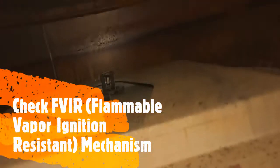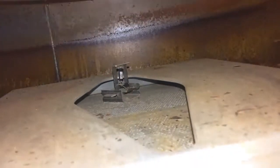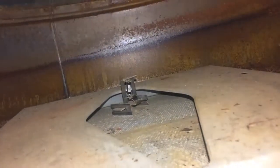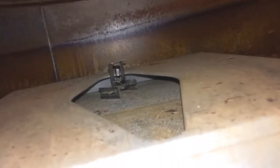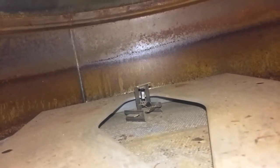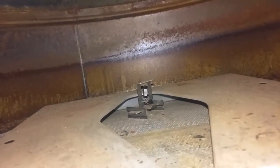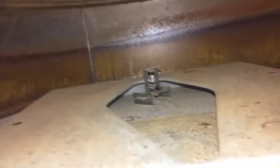The heating chamber, you can see there is a little device in there. That's actually the device to make sure that nothing has gone wrong in there. It's like a safety device, and that looks fine because you see that there is a little capsule or little bulb in there that's still intact. Usually if something goes wrong, that bulb will crush or break, and the safety device will stop the airflow from coming in, so the whole chamber will not burn anymore. So that's how the air gets in.